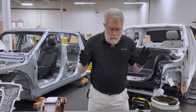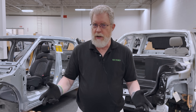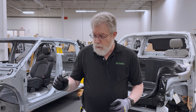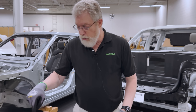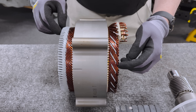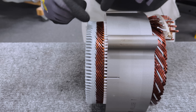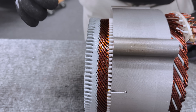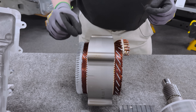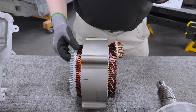So first of all, why do you have to cool an electric motor? Intuitively it makes sense that if it gets too hot, something might go wrong and might fail. But exactly what fails? In engineering, we really need to know the details. The thing you're trying to protect in the motor are the windings. If the windings get too hot, the insulation covering them breaks down. Then where the winding crosses over and one phase is close to another phase with a high voltage difference, if the insulation gets weak, then about a millisecond later you get a smoking hole in your motor that looks like a .50 caliber bullet hit it.